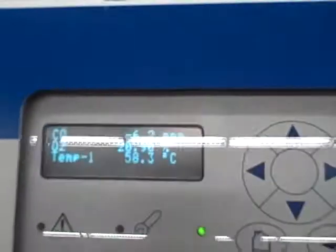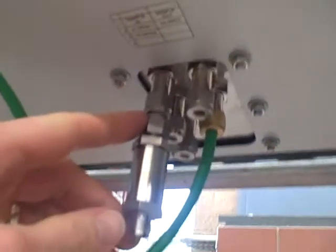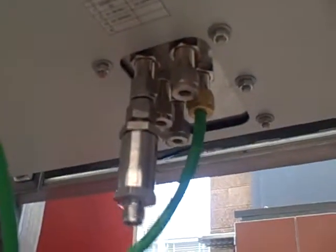The display is right up there. You can see the readouts there, and down here you can see where the sample lines are. The sample comes through this port right here through a 2-micron filter. We want to make sure that any air coming in here gets filtered of any particulate.